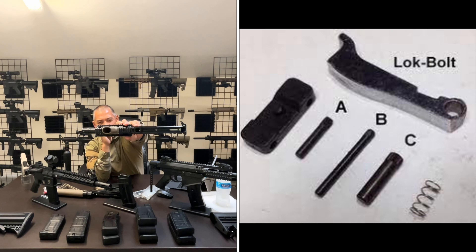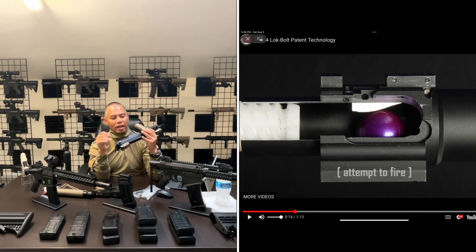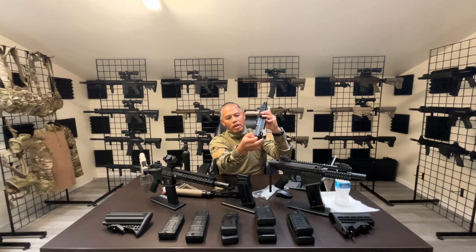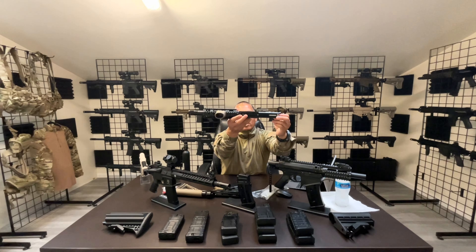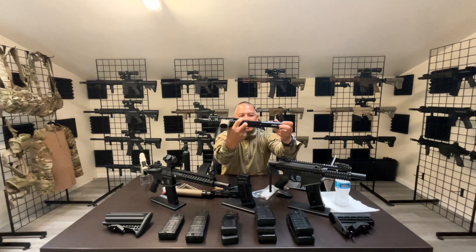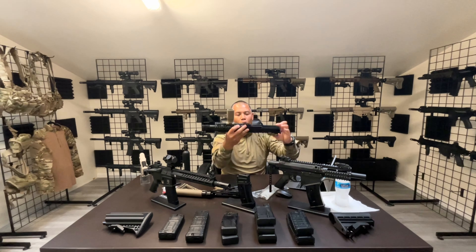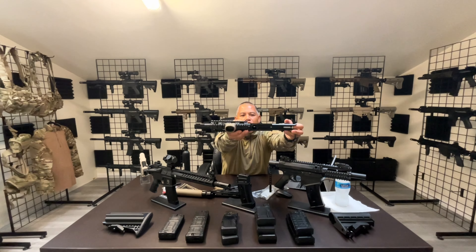You can also see the lock bolt mechanism — that little swing lever that's spring loaded. When a round goes up into the chamber and seats all the way, it'll allow the bolt to come forward; if not, it's going to prevent the bolt from going all the way forward. If I press it all the way in, now you can see the bolt go all the way through to fire. So the bolt will go all the way through versus if the lock bolt is engaged — it prevents that bolt from coming forward and all you hear is a click.